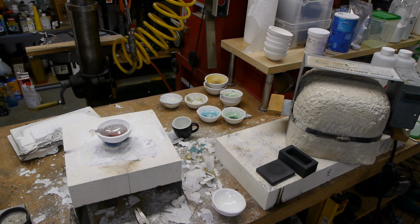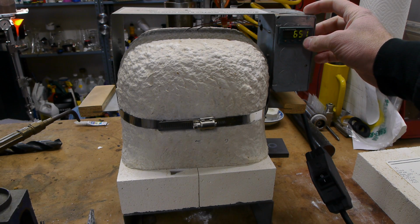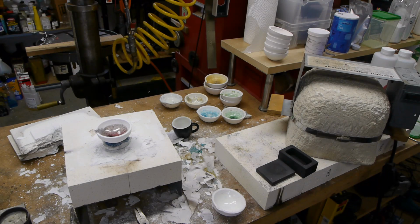There's a couple other considerations though too. You want your kiln to have really good temperature control, like plus or minus 10 to 20 degrees C, because a lot of making unusual kinds of glass involves heat treatment and annealing, and you really do need good temperature control to do this. So really fine temperature control with a gas kiln is more difficult. You probably need to throttle the gas down, not just turn it on and off. But the last consideration, and sort of the most difficult one to get around, is the atmosphere inside the kiln. Remember I was saying that a hydrogen atmosphere is no good for photochromic glass because it would actually chemically hurt the glass and prevent it from being photochromic.